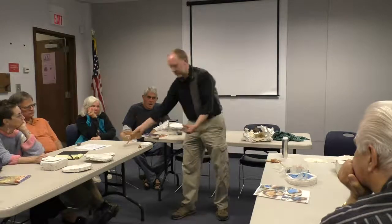So here is the little baby's face I sculpted. It's down really tight onto this piece of plastic so that the silicone won't ooze under it. Really tight. And I took some extra clay and made a wall around it, and I squished that down to the plastic really good. Now, this isn't the same one. You can see it was just this big around. The silicone was poured over the baby's face, and I had this wall of clay holding that silicone in shape. That takes like overnight to set, so that's why we're not doing it here today. I came back in and ripped the clay off, and this held its form.